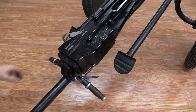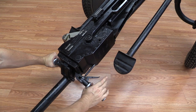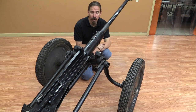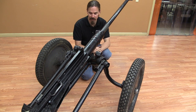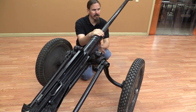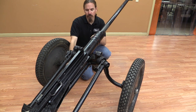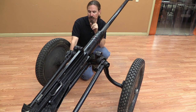The trigger is located right in front of the right-hand grasping handle. Currently we don't have a magazine in, so the trigger is locked. But you pull that, it pushes the bar forward, which runs a mechanical linkage and fires the gun. However, you wouldn't fire it from this position where it's locked into the tripod. To properly set this up for use requires more than one or two guys. This thing originally had a 7-man crew, and all of those guys were carrying backpacks full of magazines. The gun itself weighs just under 80 kilos — I think it's 73 kilos — which is going to be something like 160 pounds for just the gun, not counting the carriage.